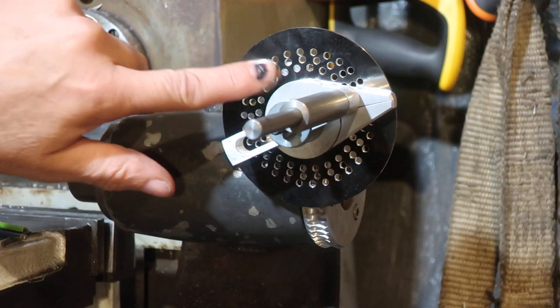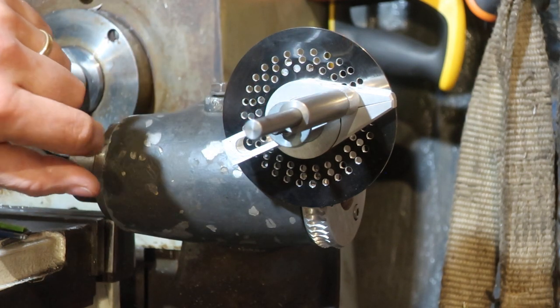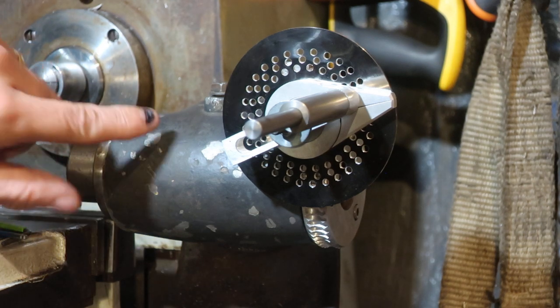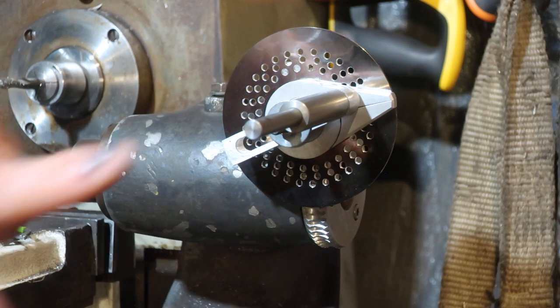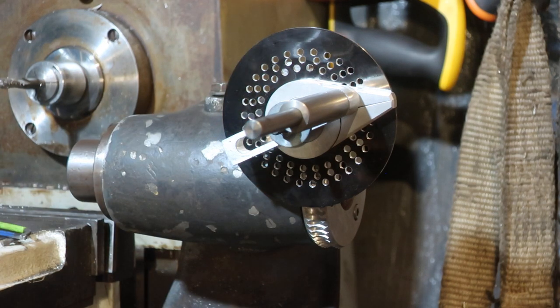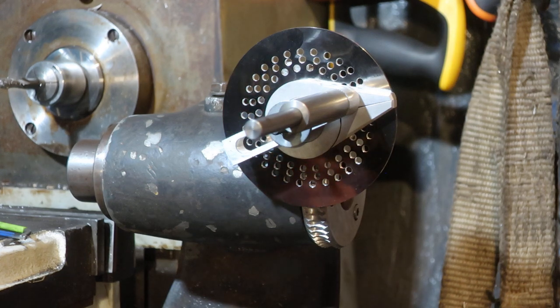What I've got here is a disc which is in fact the platter off a 3.5 inch hard drive. It has 24, 25, and 30 hole rings on it, and that will enable me to do exactly 60 divisions and a very near approximation of 61.